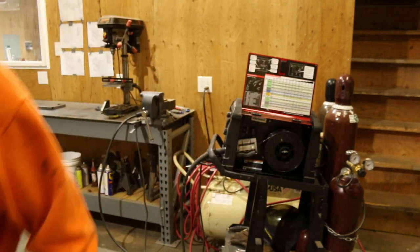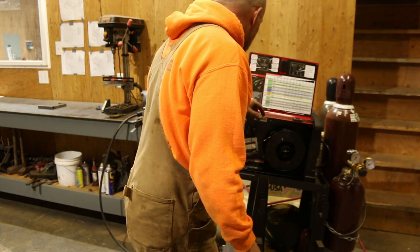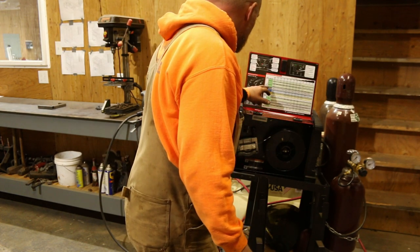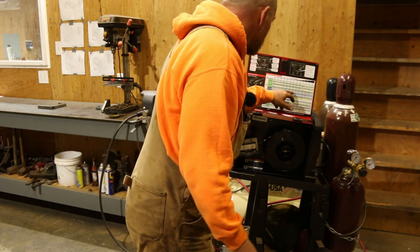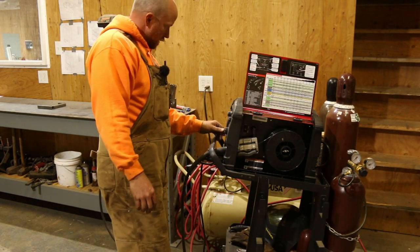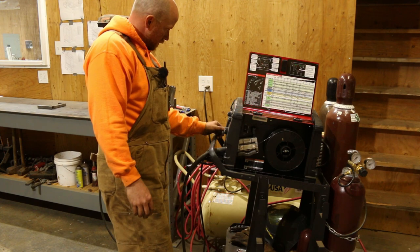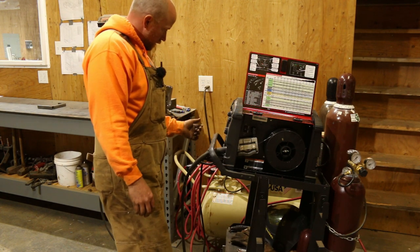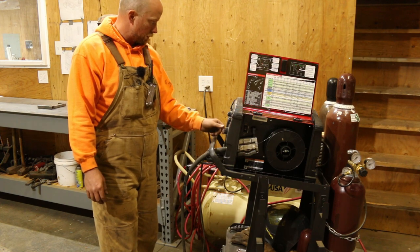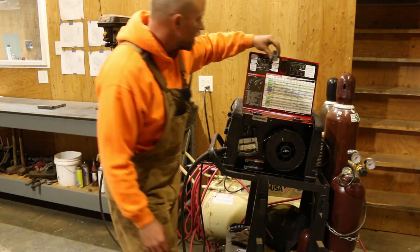which I need to go verify something real fast. So I have 0.03 stainless steel wire that we're gonna be using, and we are gonna be using shielding with the Trimix here. And I think that is like a 14 gauge. So we just need to do all the settings here. Settings. Oops, home, 230, check. We got it all set up right. Man, I haven't done this in a while. All right, you're going in the right spot. 0.03, yep. Look at that gauge. Use the gauge here.